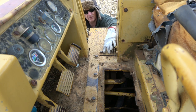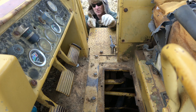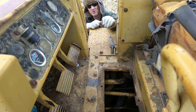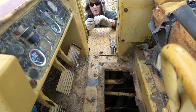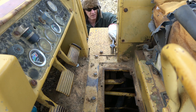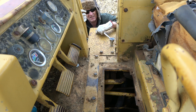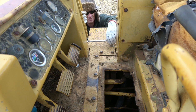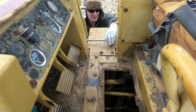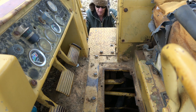The Caterpillar washers are compression washers — they're sloped, so you can press down on them and they have a little spring load to them, which keeps them from unwinding while the machine runs. This machine is real old and has a lot of rust, so I want to tighten it down a little less than I normally would, because there's actually less thread material — the rust has taken off a significant amount of threading, so they won't have as much hold as new ones would.